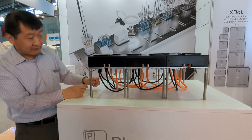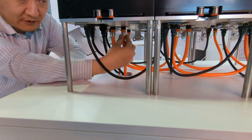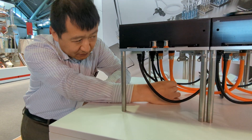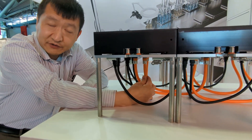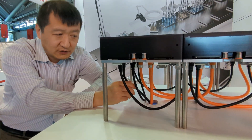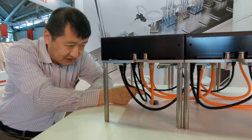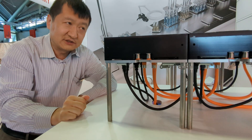The cabling is also very simple. Look here — the whole system has only one power cable going in from below. You see only one power cable; the rest of the cables are daisy-chained together. The power cable is 48V DC. And for control, there's only one network cable — see from below — the rest again daisy-chained together to form an integral system.